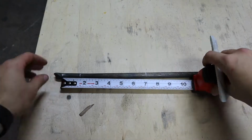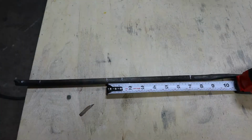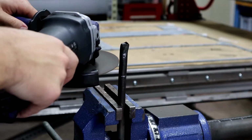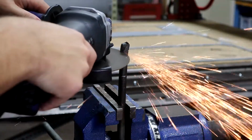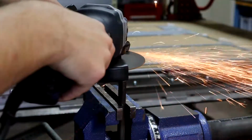Today, I'm forging a pair of curtain tie hooks. I'm cutting out two 7-inch lengths of 1/2-inch diameter round bar. I've roughly indicated the size of the tabs, but I'll set this at the anvil soon.